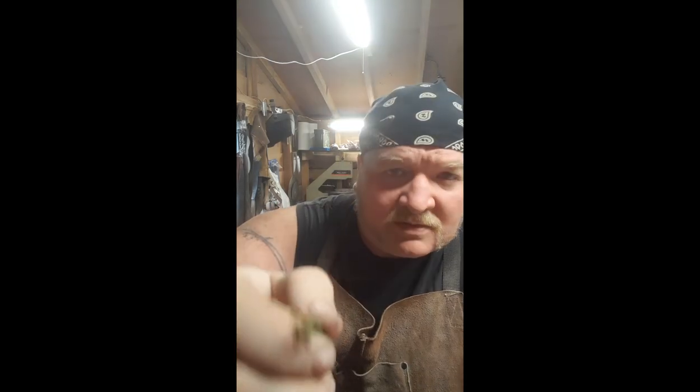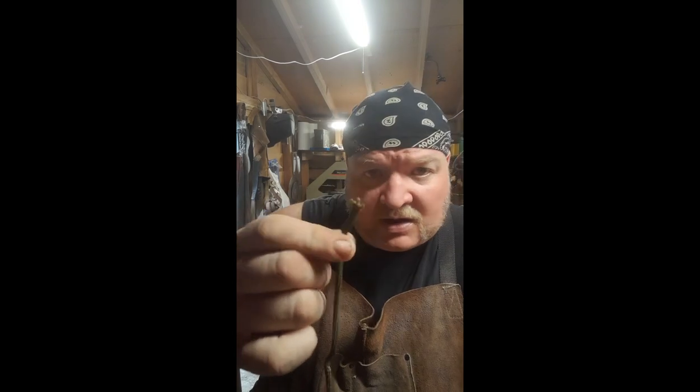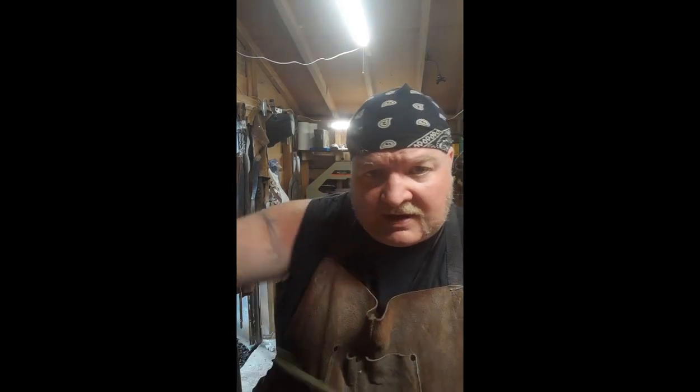Number one, there's no core. True paracord has 7 filaments inside it. That's what makes it able to hold up to 550 pounds. In the military, we call it 550 cord. If you want good survival stuff, actual 550 cord is what you need. This is cheap junk. This resembles the piece that goes around the 550 cord, but it is hollow, it is weak, it is easily cut, I could probably break that. It's all kinked up. This is useless.